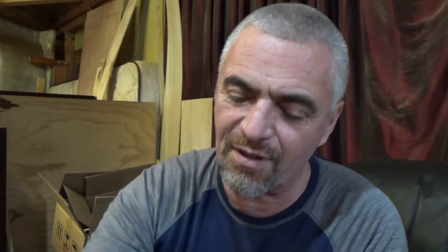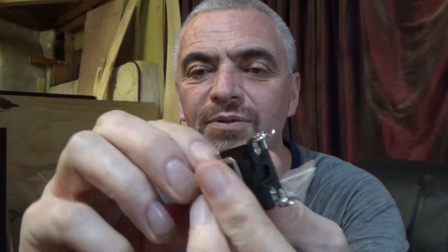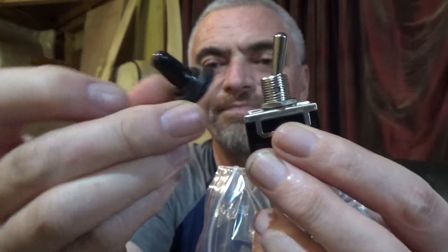Also some more switches. These ones are a fairly solid sort of switch — I think these are good for 10 amps and they are a 2 pole. I quite like that they have screw-on fittings, which is why I went for these ones rather than the push terminals. They've got a nice solid feel to them, and they actually come with a waterproof little cover that goes over the top to make them fully waterproof if installed as such.